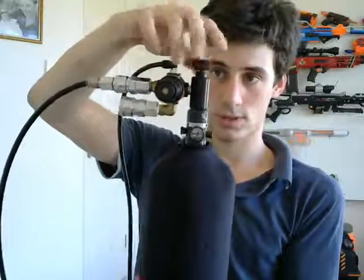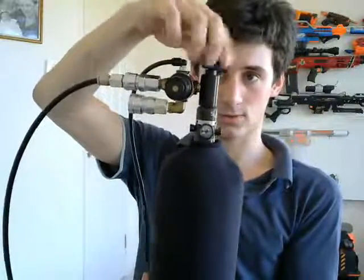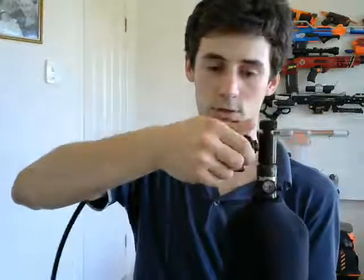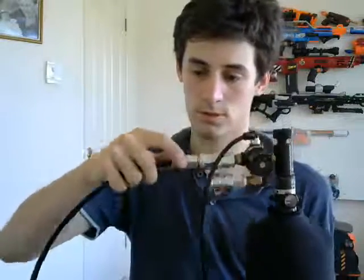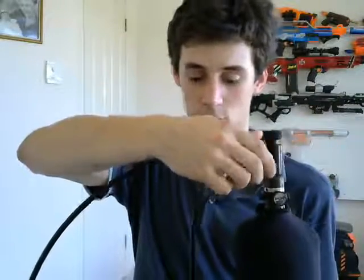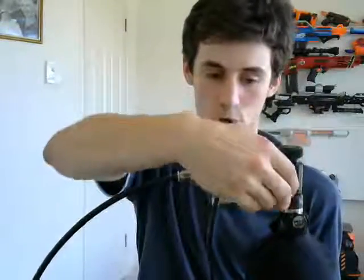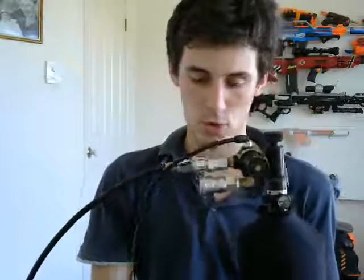So, to operate this bottle, first stage, you screw this thread down until it is all the way down and cannot screw anymore. If you have your regulator already set to 0, it will read 0. But if you adjust the pressure, that's currently a leak in my push fit, but if you push the pressure up, keep pushing, regulate it up to around 50 PSI.